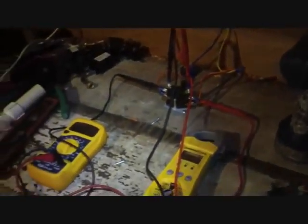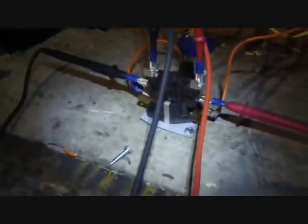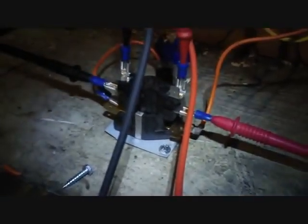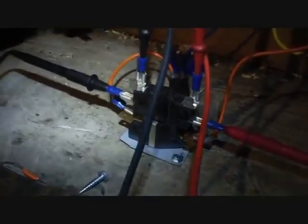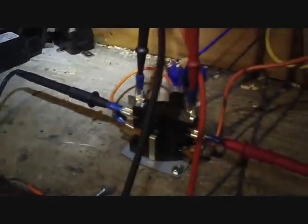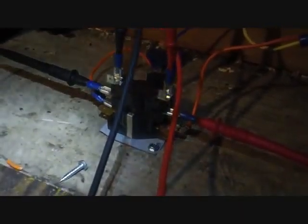The relay we're working with is a 10KW sequencer, and it works on the premise that low voltage is sent to these bottom two terminals and runs power through a bi-metal strip. The bi-metal strip has two sections, two types of metal — one of them flexes with electricity more than another, and causes the contacts to collapse.